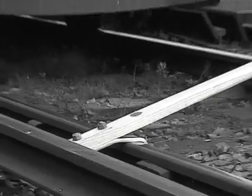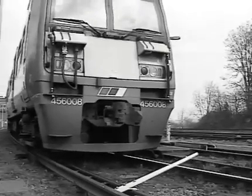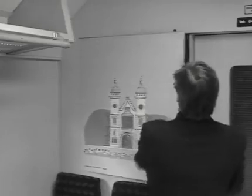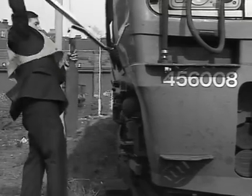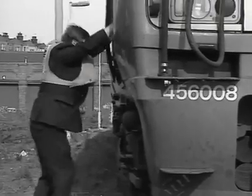If fire or serious arcing occurs on class 455 or 456, follow the same procedure as for 1963 stock. In the case of fire where units are coupled in multiple, you must trip the battery positive MCB on the affected unit to prevent restarting the fire when the auxiliary set button is depressed on the unaffected unit. If the fire is on a single unit, the battery positive MCB must still be tripped — this is most important. In this case, of course, assistance will be required.